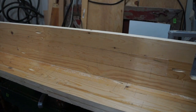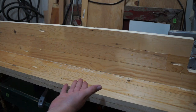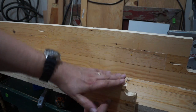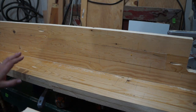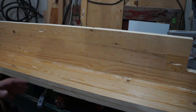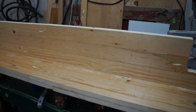I put the little lip here on the bottom, so this will rest up against the bottom of the mantle. Another option was to actually build out underneath the mantle to enclose it fully, but once I put it on I realized you couldn't really see it anyway. The other limiting factor is because I'm repurposing lumber — I only had a limited amount, and I ended up using all of my boards just perfectly. This strip was my last board. Now it's time to sand.